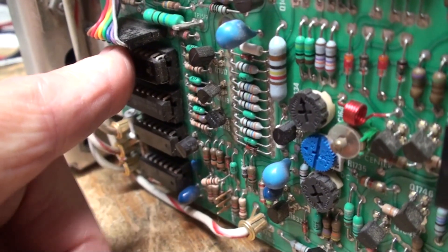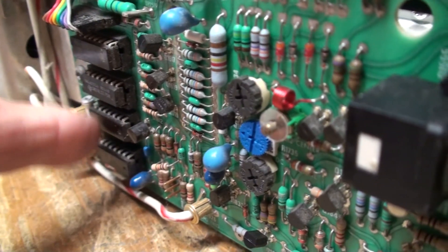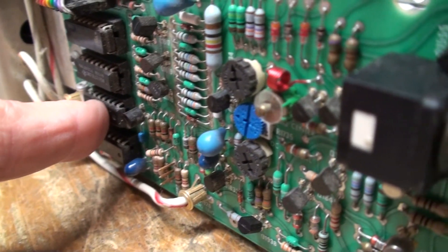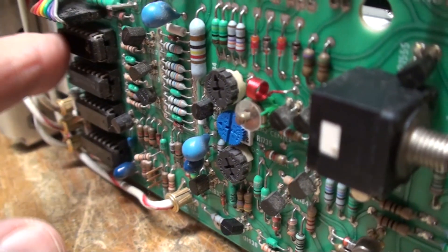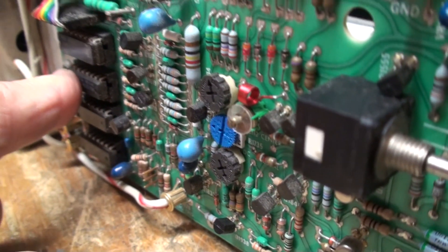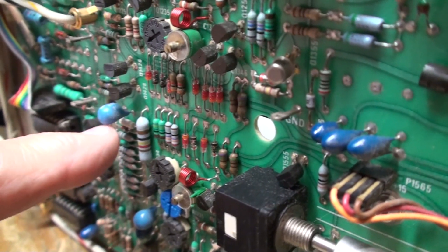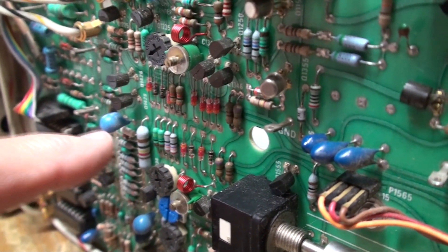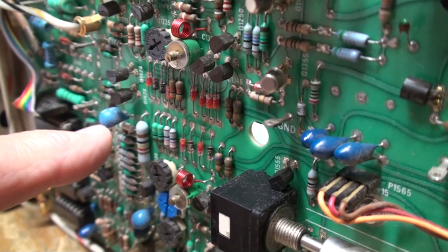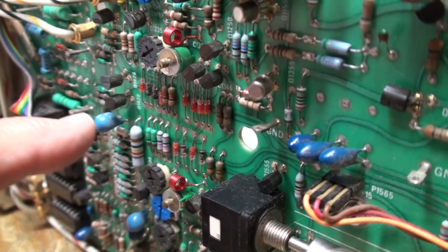These are pretty warm. This is pretty warm right here. I'm not worried about getting zapped — it's all low voltage stuff. I have one of those infrared thermometers so I can measure the temperature. You've got a lot of tantalums in here, and I've got to do some reading up on them. Guys have been replacing these with regular electrolytics — I can never understand that. I'm sure somebody would chime in as to why they ever use tantalums. Maybe because they're smaller, and I don't know if they're polarized or not, to tell you the honest truth — I've never changed one.